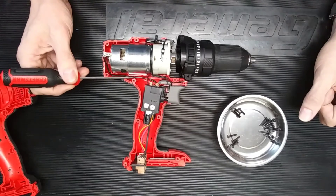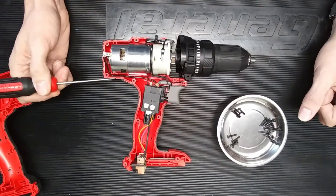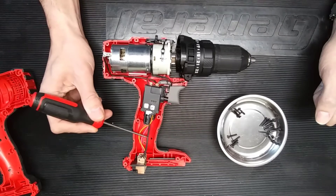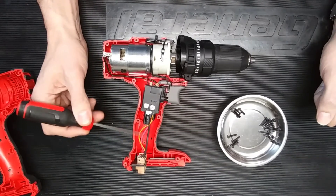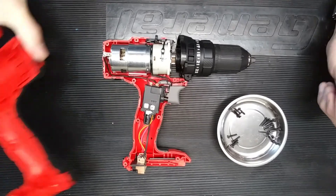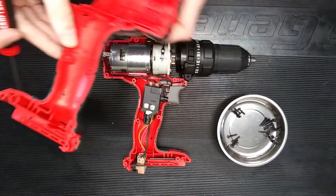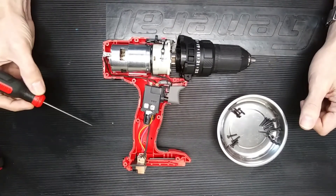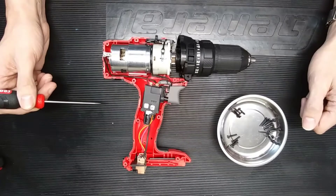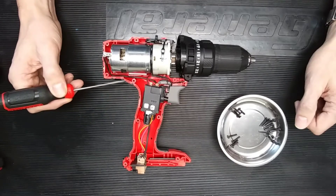Something else I see here is there are nice wire traps to hold the wiring in place — that's very nice. It prevents loose wires from rattling around under vibration, which could affect the longevity of the tool. Although there are no wire traps on a couple of these wires, they're a relatively short distance, so I don't see that as a huge deal. Also, what's stamped on the inside of the housing is GFPP — glass-filled polypropylene. That's a good material for housing. It has high impact strength, high continuous operating temperatures, and reduced deformation under long-term stress. As an option for the designer, that's a great material choice.